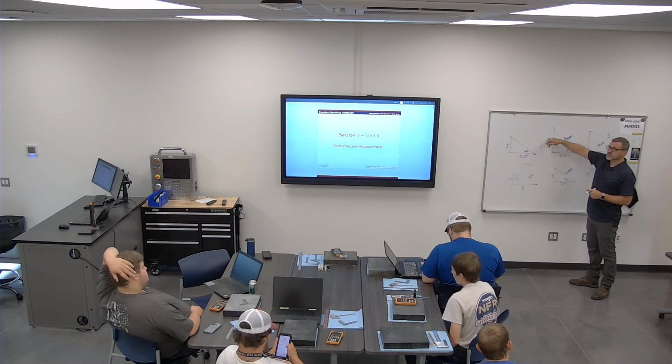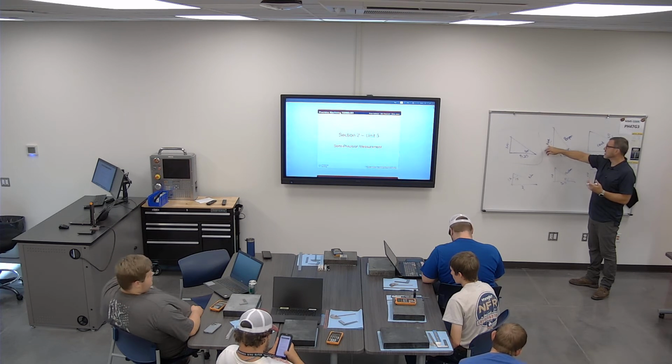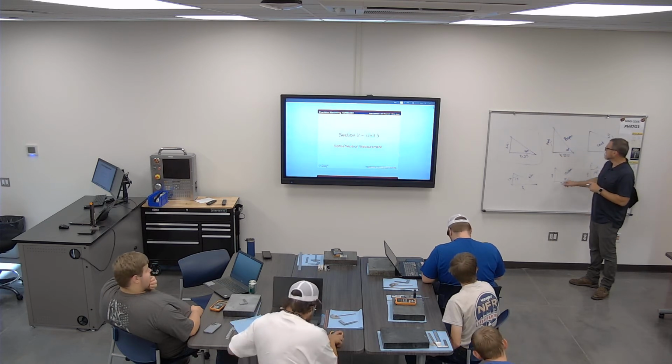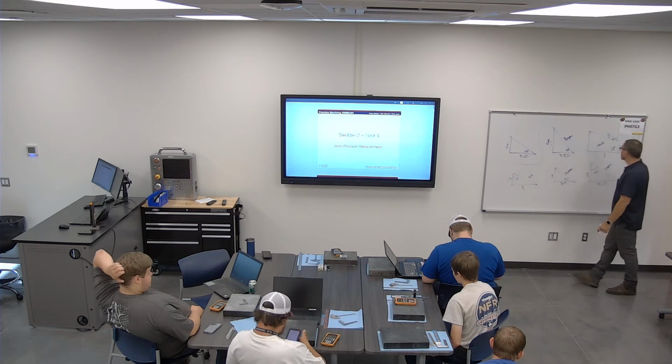So if there was change on the end of that, you could say 4 inches. I typically would say 4 inches, comma, 612 thousandths and 3/10. But you could say 4 inches and 612 thousandths and 3/10 or whatever it might happen to be. I'm not going to double check you, but since I know this angle is 50 degrees, I know this line should be longer than this line, so I think that's probably right.